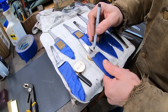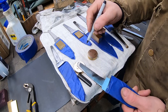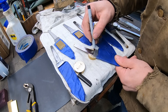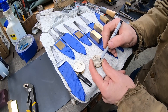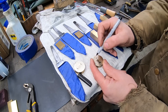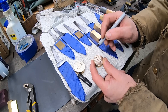The next thing I'm going to do is just mark the width of my tang right up against the ricasso. At this point, none of these are super precise measurements because I've got leeway in my stock. I want to be careful not to come right out to the edge here, so I'm going to come back in. This is my outer limit — I need to sneak up on that dimension so I don't go over it.